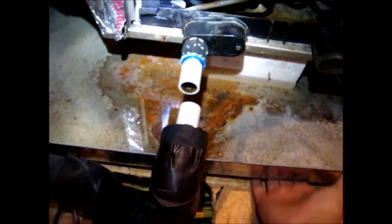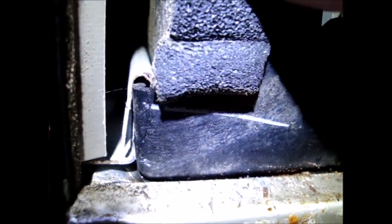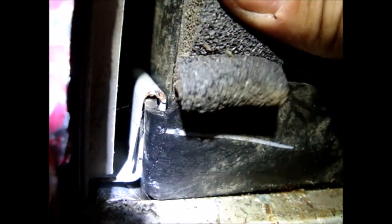Came out to this water leaking call. I was thinking it might be the drain being blocked up because this pan is full of water, but that is dry. Upon further investigation, that drain pan is cracked here — but it's completely broken back on that bracket. I mean, completely.